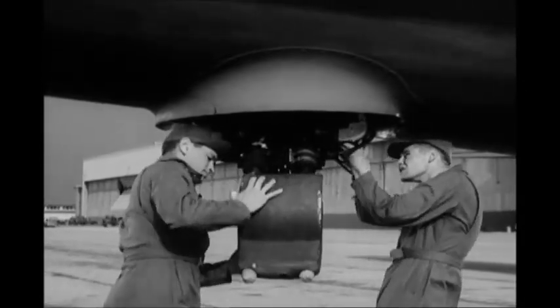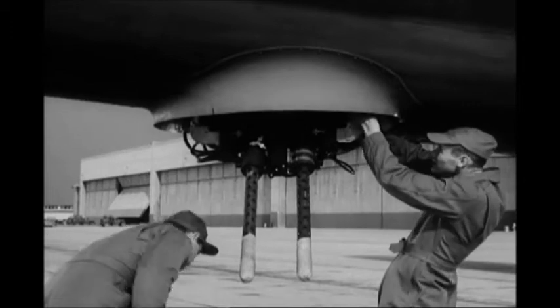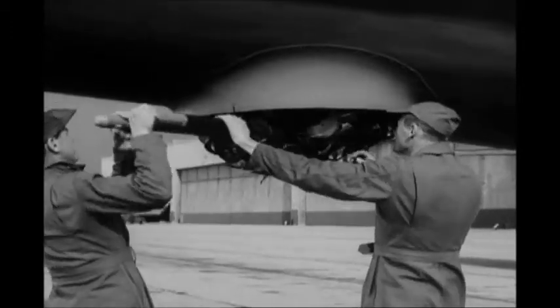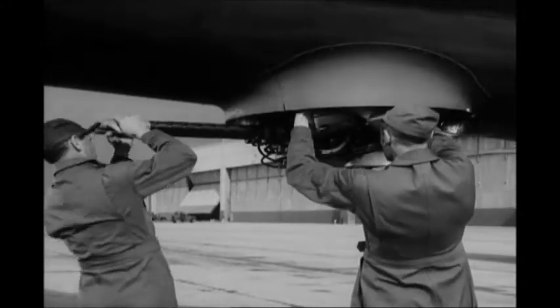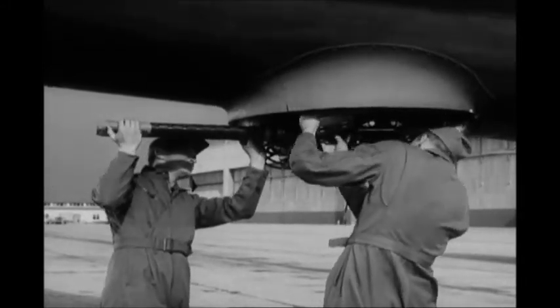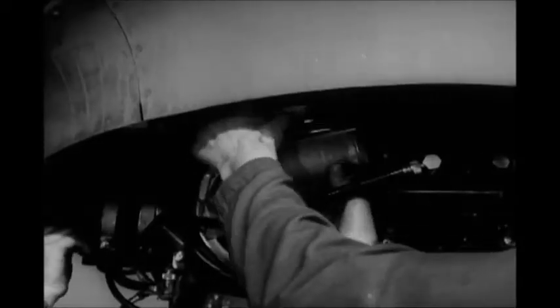will work properly. They must inspect all 5 turrets in the same way they're now examining this lower rear turret. After they have the dome and gun cover removed, they see that the ammunition moves freely in the chutes and is correctly loaded. The guns just don't fire with the cartridges in backwards.